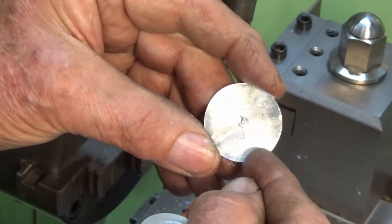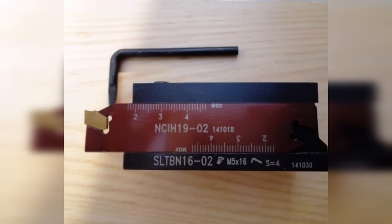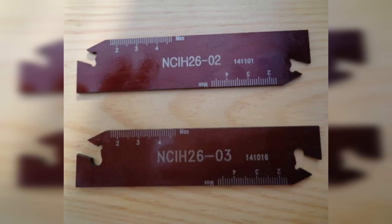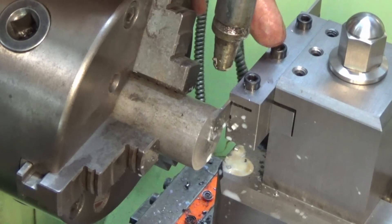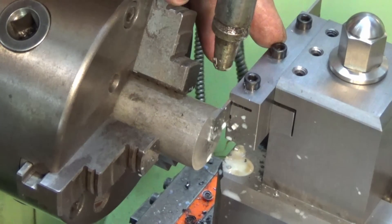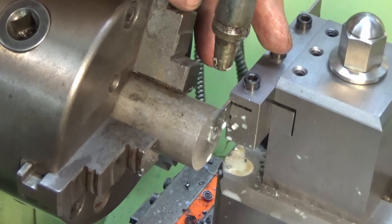Of course if you've got a super heavy, super rigid lathe then you're laughing, but for me as a hobbyist, if I can get that sort of result I'm really happy. I have actually ordered an insert-type tool holder with a 3mm wide blade — this one is only 2mm — and it's 26mm deep, so I should be able to get a much deeper cut with that style of insert cutter. When that turns up I'll make another tool holder and we'll revisit this and have a look at it again. That's all I've got for today — thanks for watching. If you still have questions or suggestions, put them in the comments. The more information I have on this process the better. It's Preso signing out — see you next time.